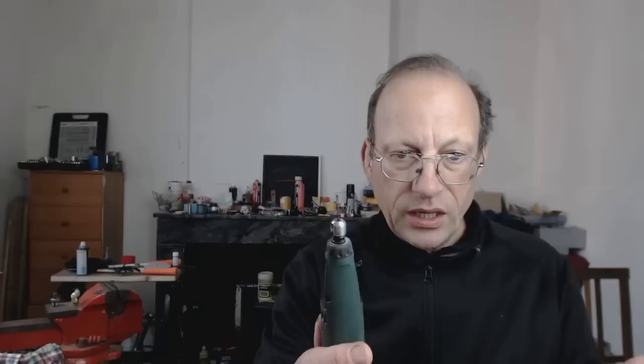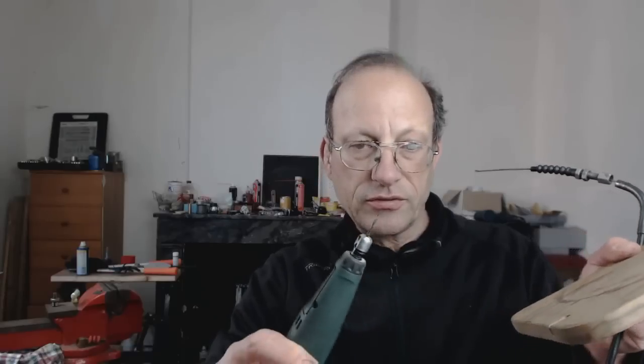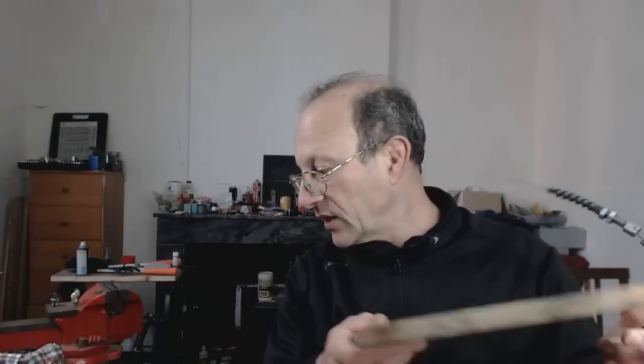central. And so using a 2 milli drill in a Dremel type affair, it was just a case of milling the slot down. And then finishing, it just takes the curve, and then the Bowden cable can just sit nicely in it. And so that's ready now. Yeah, that's the mould ready. And we just need to set up how we're going to hold the cable in place, and then get ready for soldering.